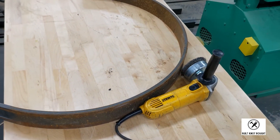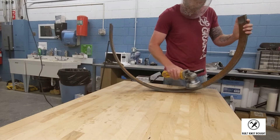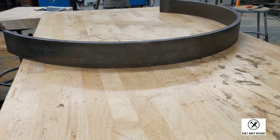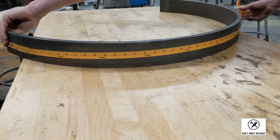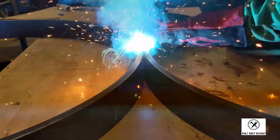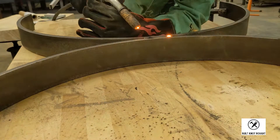Now on to the legs. The client provided me with four parts identical to this one here. They were a little bit rusty, so I used a wire brush and cleaned up all the rust on all of them. Then I started to get my layout down. Measuring these curves was difficult, so I ended up using a flexible ruler to find the center points of all four hoops. I marked the center point so that when I went to tack weld it, I would have equal parts above and below that center line so the table would sit flush. I started tacking everything together with some solid beads to keep it relatively straight and flat.